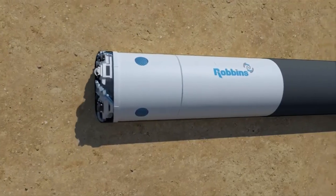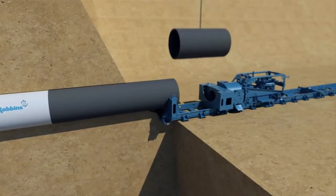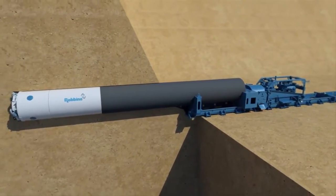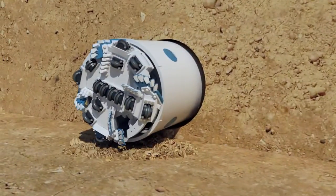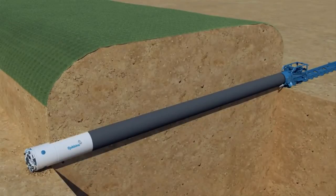As the SBU-M excavates, new casing lengths are bolted or welded to the previous casing. The ABM generates forward thrust to continue advancing the machine as casing lengths are added. At the end of a bore, the SBU-M breaks through and is removed. The primary liner provides a lined tunnel in which to lay the carrier pipe.